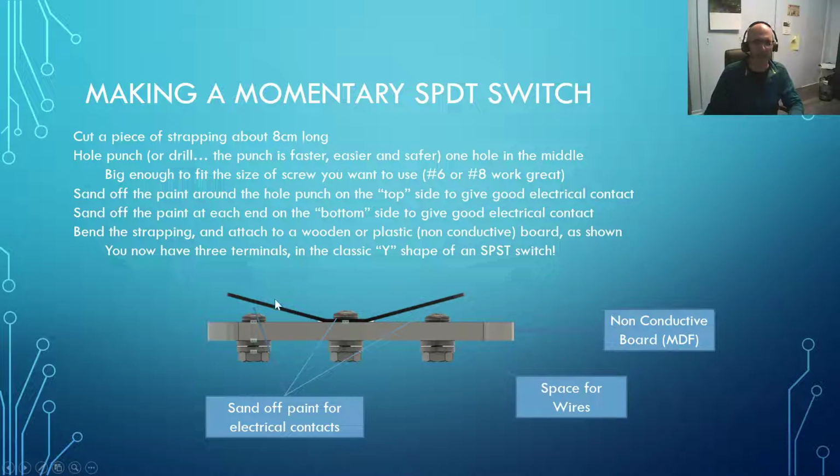So what's going to happen is that when you put electrical power into right here, if you push down on this side, it connects it and comes out right here. And if you press down on the other side, it comes out right here. Nothing too fancy going on right there, and that's one of the reasons I like it. When you do this with the grade 9 and 10 students, they can actually see it happening and see what a switch does. And as you'll see in just a moment, this actually looks like the schematic symbol for a single pole double throw switch.